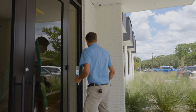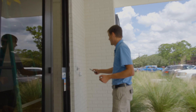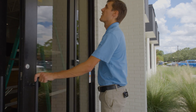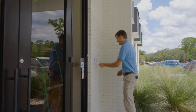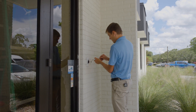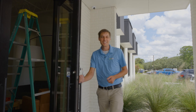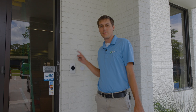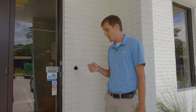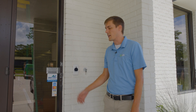There we go — we're closed again. I'm gonna grab the key and test it out to see if turning the key opens the door. Door is closed, magnet is magnetized. Turn the key — and now we're open. We did it. Now I'll just finish the last touches: put the screws on and put the cap on. That's our UniFi Access system failover. If we have an issue, we just come up with the key, pop the little plate off, and we're now unlocked. It's a great system in case we get locked out of the building — we don't have to break through a window.